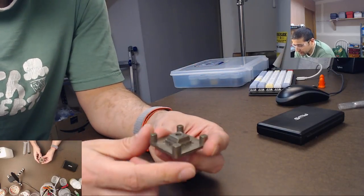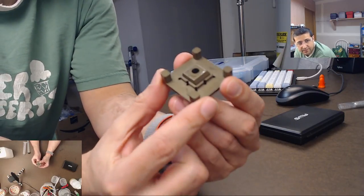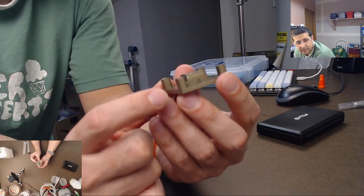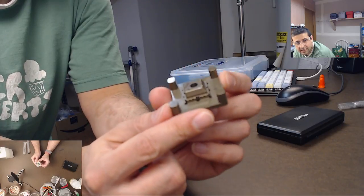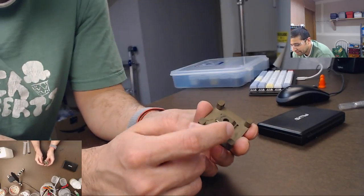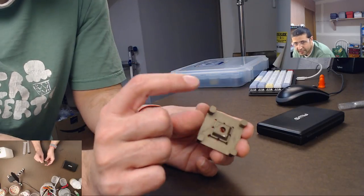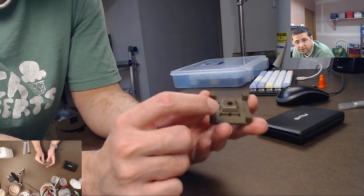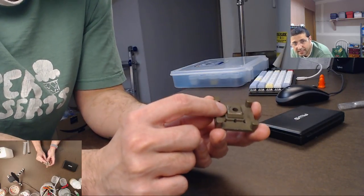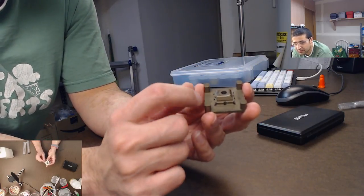And so what you do with this particular tool is you can see it's shaped like a cherry keycap. It's shaped like the Cherry brand Cherry MX slider keycap, the bottom of it. So what you do is if you put sculpting material on top of here, it ensures that it will actually sit on top of the key of the switch correctly, so it'll still actuate the switch. Because the problem that people have sometimes with their keycaps, what they don't realize they're doing when they're molding them or when they're sculpting them, is they don't leave enough room.